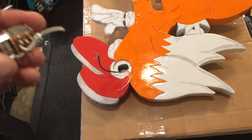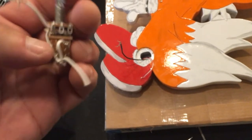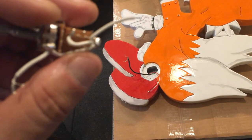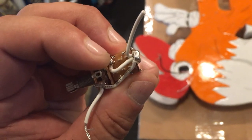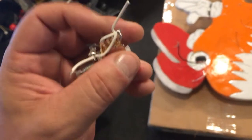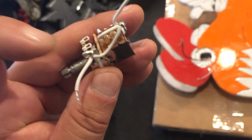All right, let me show you what I mean as far as pre-wiring my coil split push-pull pot. And you push it, and then when it's down, it activates both. What I do is I go from that ground, this is the ground channel, I go to the ground to the body of the, it grounds several places, but I want to make sure that completely ground, there's no ground issues. So you go to the ground to this top post, your red and white will be connected there, and then this will go to the ground for the input jack, and also, this will go for the input, the ground for the pickup, and this will go for the ground for the input jack, or actually hot for the input jack.